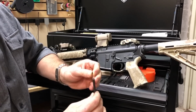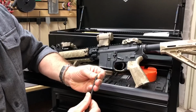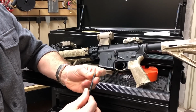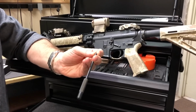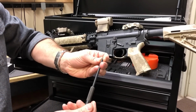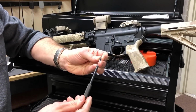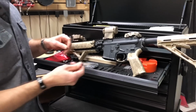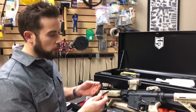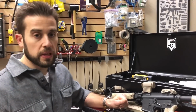Anyway, the object with the roll pin holders is that the roll pin fits in a groove like this so that when you're hammering it, it's kind of trapped inside of there. So again, the premise is without something to stabilize the roll pin, it can jump around and walk, and it's more of a pain in the ass to put in. So the tools basically have that role. They're there to stabilize the roll pins or hold them like that when you're punching them in.